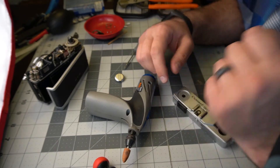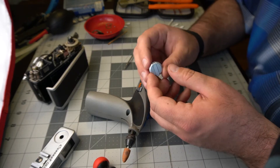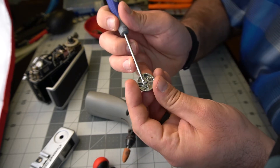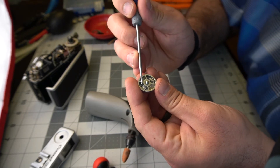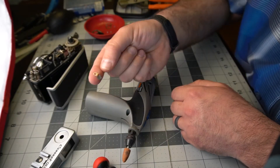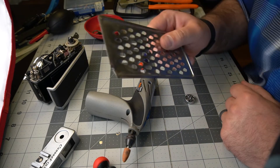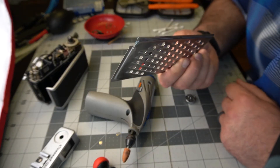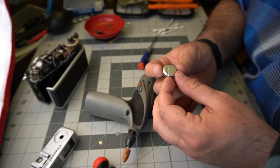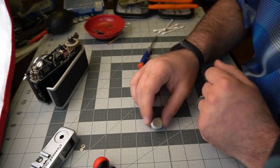Well, things got a little bit complicated. I cleaned up the top cover and then started messing with the rewind lever. There's a spring right here — I broke it; here it is in two pieces. So I made myself a new one out of the edge of a cheese grater. Be careful when you're screwing around with tiny little 50-year-old springs. I had to Dremel some things and things got very complicated. But let's put this back together.